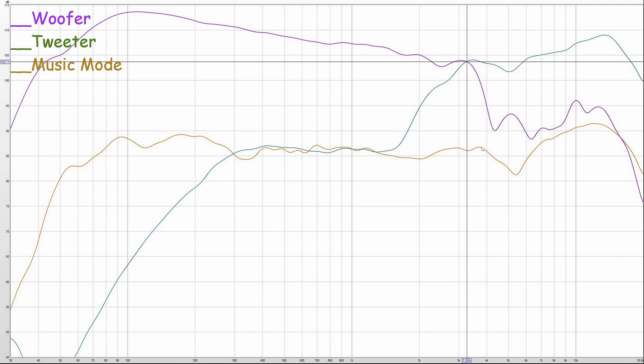Anyway, waffle waffle waffle as usual. Just gonna show you what I found and where we are now with the 5.5 kHz - and indeed, where is that crossover? Is there a proper crossover? I'm also going to tell you where the passive radiators are tuned. So the brown line is the Tribit Stormbox Blast in music mode, default mode, with the grill on, with the light bar for the woofers in place. You can see the issue - it's the 5.5 kHz dip. And the question is, has its physical makeup got anything to do with contributing to that 5.5 kHz dip? I've removed the grill, I've removed the light bar that covers the woofers. I've measured separately the woofer and the tweeter. So first of all we can see the crossover point - about 3.3, 3.5 kHz - that is classic crossover territory.